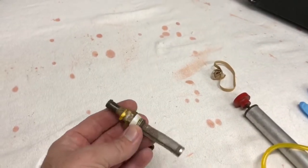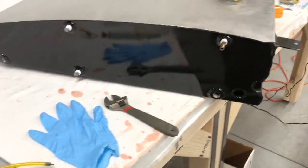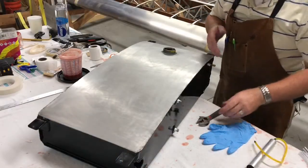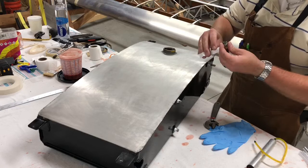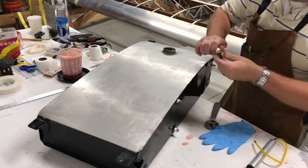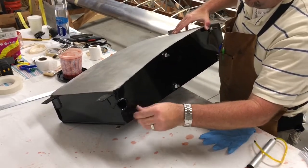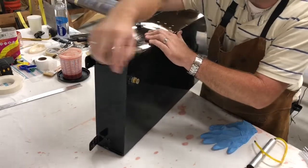What you want to do is put your original nipples back in — these go in the tank this way. Then take Teflon tape and put Teflon tape on your fittings so that way it gets a good airtight seal around the threads. Just take that and thread all your fittings back into the tank good and tight.